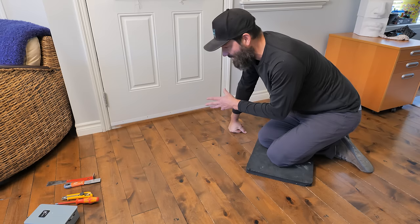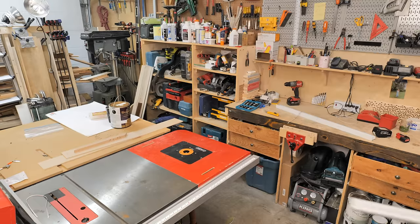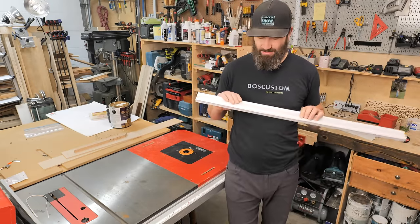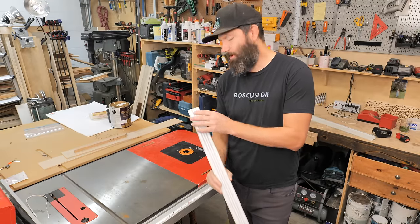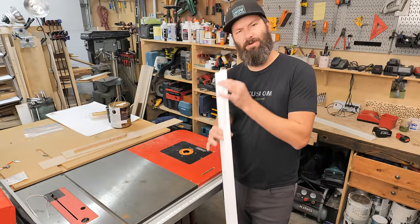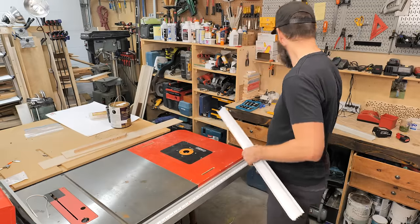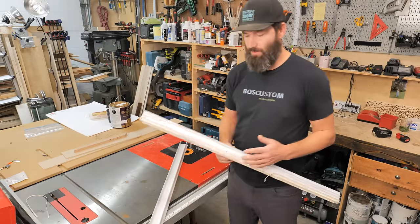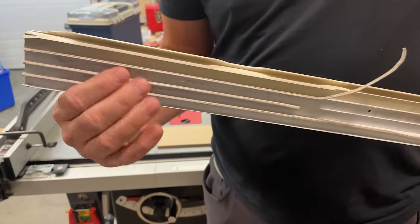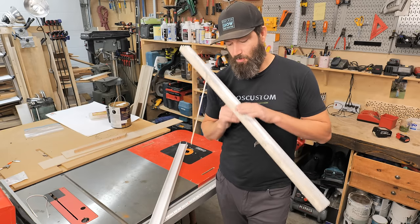Let's test the fit. That's fitting terribly — I thought it might. I'm going to show you how to get this to 100%. I opened and closed the door a bunch of times to see where it's wearing. The two little rounded-over bits are showing a lot of wear, especially in the center. The front flashing is just folding over and jamming on the sill. Looking at the old sweep, the center is completely worn off while the outsides are still intact — the gap under the door is humped up in the middle, causing more wear in the center.